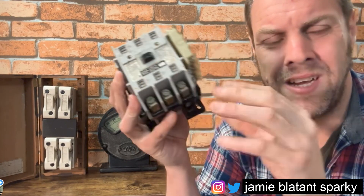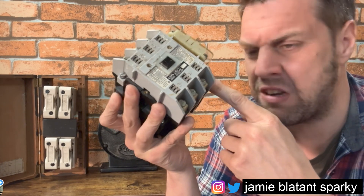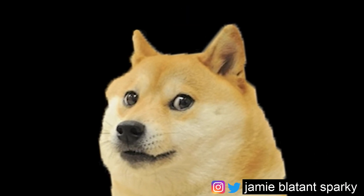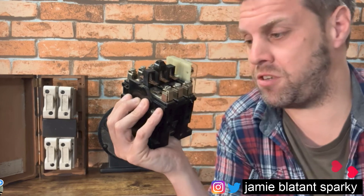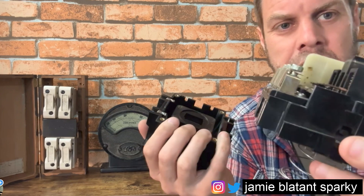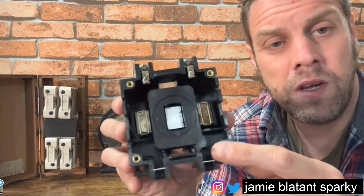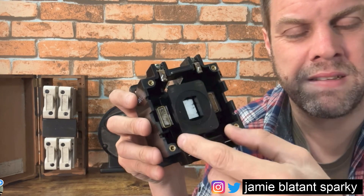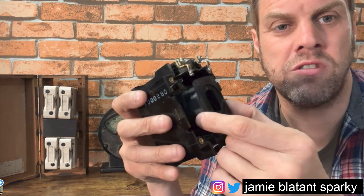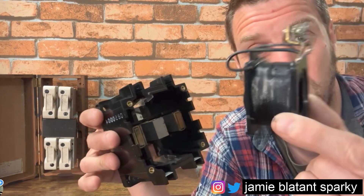This was an effort to make them modular, and now they are extremely modular. You can't really take apart a modern contactor - the general ones don't come apart - whereas on this one the top comes off, which reveals the top section. Then amazingly the contact section comes off to reveal the contacts inside. Working backwards through this: in the bottom you'll find the coil. There are the magnetic plates that form part of the magnet, the other half is there, and that is the coil just there - the coil section. So you could replace that.